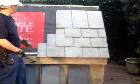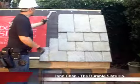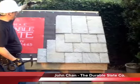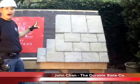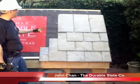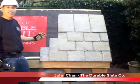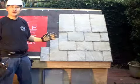As we're going up the roof, we're going to angle our lines so that it goes straight to the top and looks perfect to the eye. Because no roof is going to be actually perfect in height from one side to the other. That's the way you do it, the Durable Slate Company.